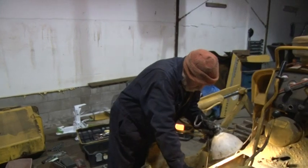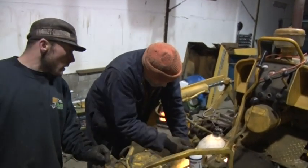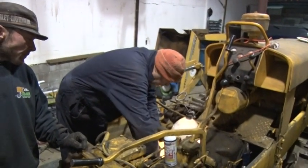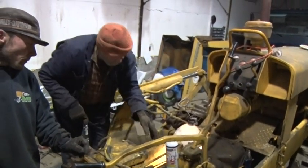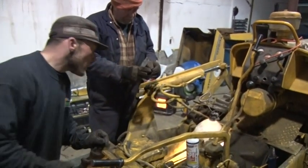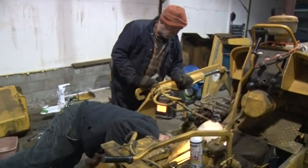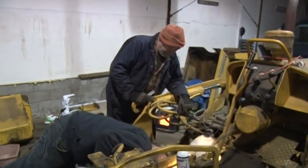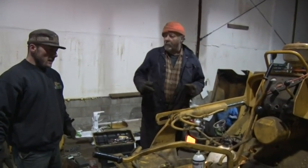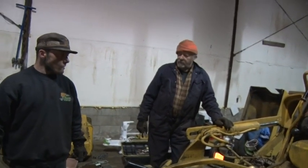I put a light up in here, and you see where this axle tube goes across there? We got the front half of the bell housing curls down underneath it. Now when we pull the transmission back, the input shaft is going to come out of the clutch and back out. Do we have enough room to come straight back? We're gonna find out. We come straight back, and then when we go back in, we might have to pull the bell housing off of this and everything. You understand what I'm saying?